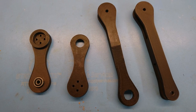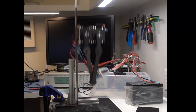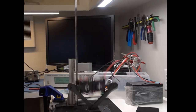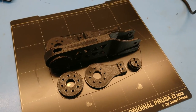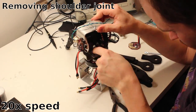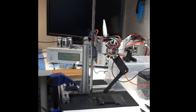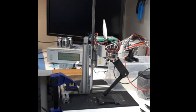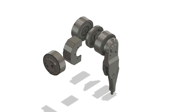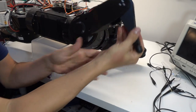The next step was assembling those servos into a leg. I started with a side-by-side geometry using the 3508 motors. Once I was using the slimmer 60mm and 81mm direct drive system, and subsequent servo drives, I switched to an inward-facing coaxial mechanism, with a 3mm timing belt driving the lower leg. And now I have advanced to an inline coaxial mechanism with a 6mm timing belt that allows nearly complete rotation of the shoulder joint.